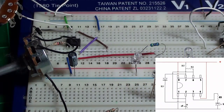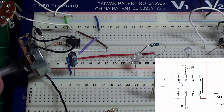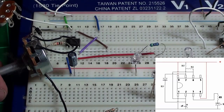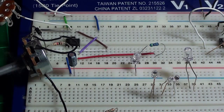You can see that's controlling the length of time the LED is lit up. This one here — that's R3 — is controlling the time between blinks. So when I start changing this one it takes longer to go between blinks. There we go — adding a diode and a resistor gives me the strobe circuit. Real simple fix to turn it into a strober.